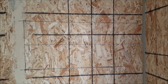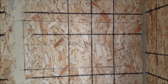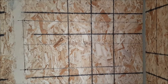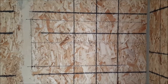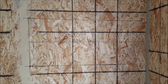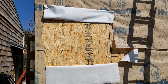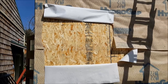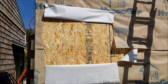We finally have our lines for the rough opening of 30 by 18 inches. I went ahead and cut those — it's okay to slightly overcut the corners. You can do that with a jigsaw; I used a drill bit big enough to go through the wall, about a six-inch bit, to get into the corners. Then I went outside, peeled back the house wrap, and marked our 18 by 30 to correspond with the lines on the inside. Now I'm ready to cut that out.